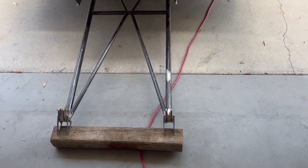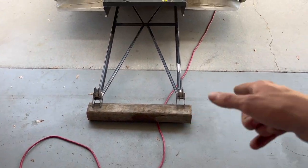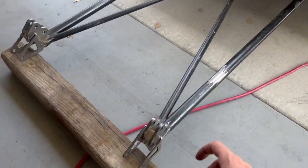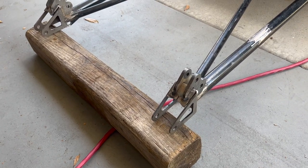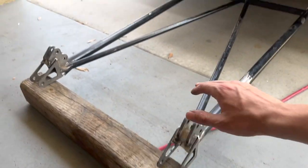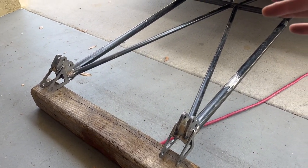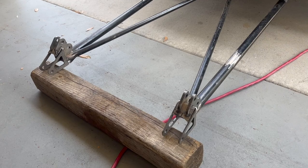But yeah, the top bars are actually a little longer. That's because the wheel housing and the trailing arm position in the race position was in a different location on the old housing. They were more like up here, if that makes sense. Like this part was way longer. This housing is shorter than the other housing, plus these are in a different location. So I just have them tacked up for right this very second. When I get the heim inserts for the top bars, I'll put them both up there and I'll see where it all lines up. And if I like it, I'll finish weld it.